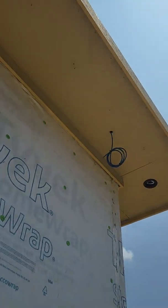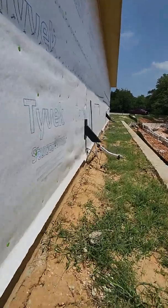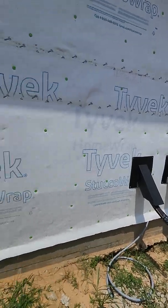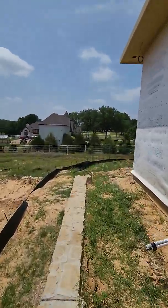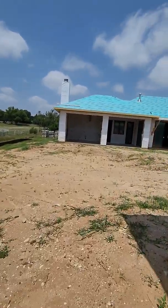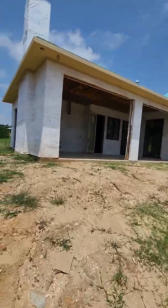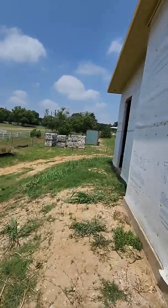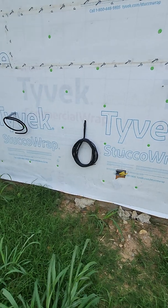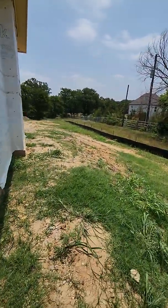Here's one of our camera wires up above — Cat6 wire to cover everything back on this back gate. Coming back here, we still have to wrap this wire but we got our two 16/4s and a Cat6 so they can do their Origin Acoustic speakers, and if they ever want to do any type of TV out by the pool they're going to be able to.